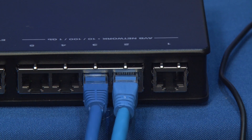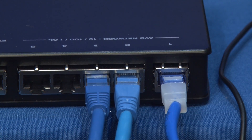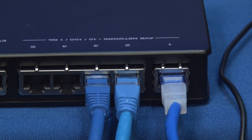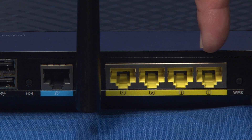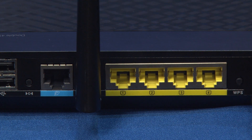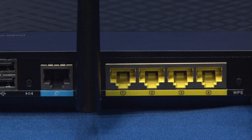The first thing you need to do is connect your console mixer and your rack mixer to the AVB switch with your Ethernet cables. If you're using the router, you'll want to plug that into the switch as well. Make sure that when you plug in the router, you're using one of the local area network ports or LAN ports, and not the wide area network port or the internet port that goes out to your internet connection.